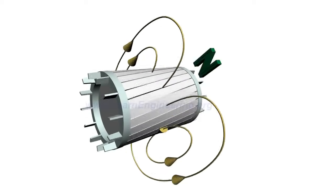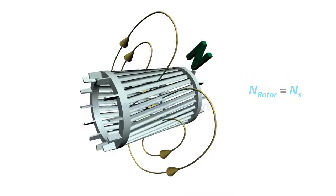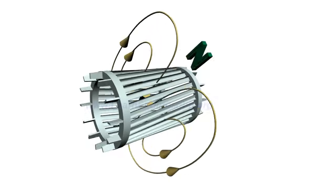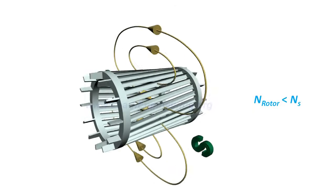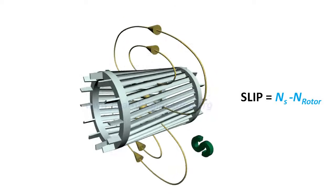Both the magnetic field and rotor are rotating, but at what speed will the rotor rotate? Consider a case where the rotor speed is the same as the magnetic field speed. Since both are rotating at the same speed, the rotating loop will always experience a constant magnetic field, so there won't be any induced EMF and current — meaning zero force on rotor bars. The rotor will gradually slow down. But as it slows down, rotor loops will experience a varying magnetic field, so induced current and force will rise again and the rotor will speed up. In short, the rotor will never be able to catch up with the speed of the magnetic field. It rotates at a specific speed slightly less than synchronous speed. The difference between synchronous and rotor speed is known as slip.